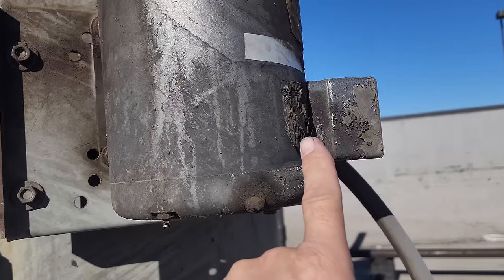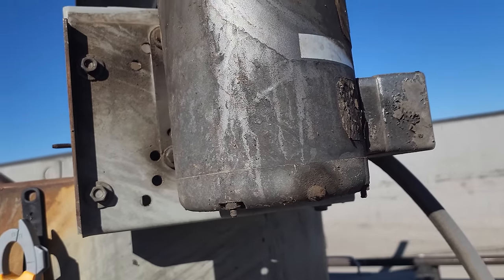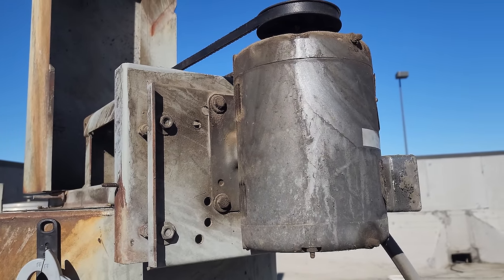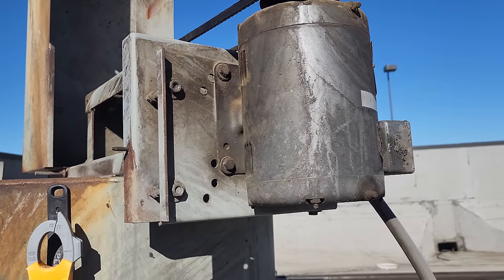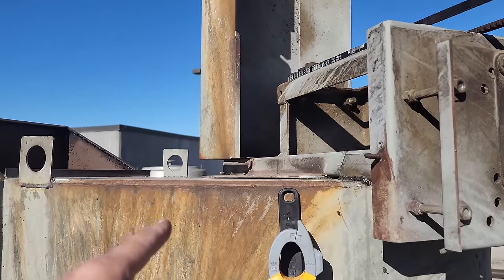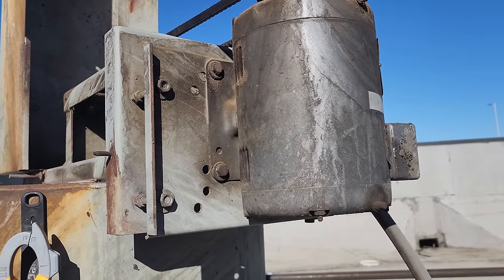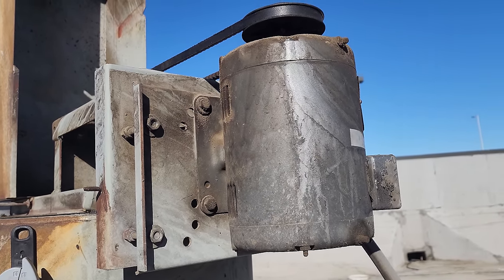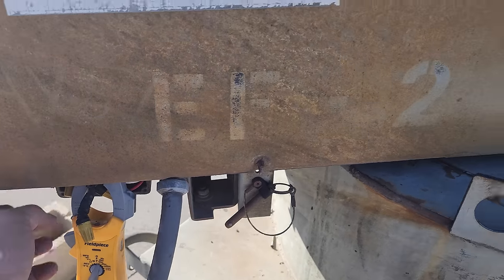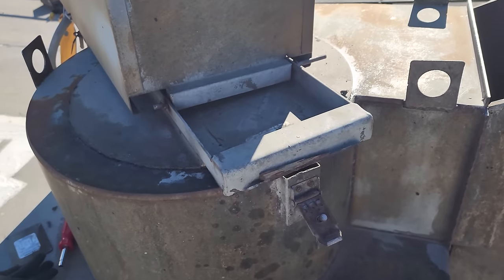And again, because of the high heat, you can see how it's been running under a load and it wouldn't trip until it potentially tripped a breaker. So I don't trust this motor, but I still wanna see what's going on, maybe what caused it to trip. We also need to inspect the internals of the fan because sometimes they can get towels in there. So we don't know what initially caused the motor starter to try to trip. Safely close the lid where nothing was gonna short out, because we need to lift this fan up. Pulled this guy, again, you don't wanna do this with this running.